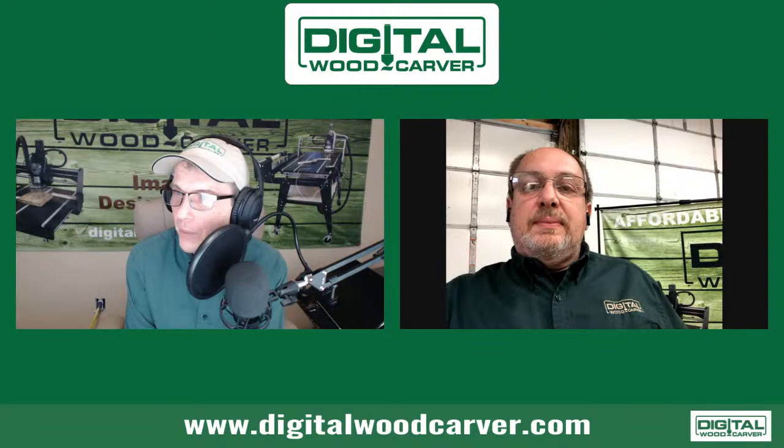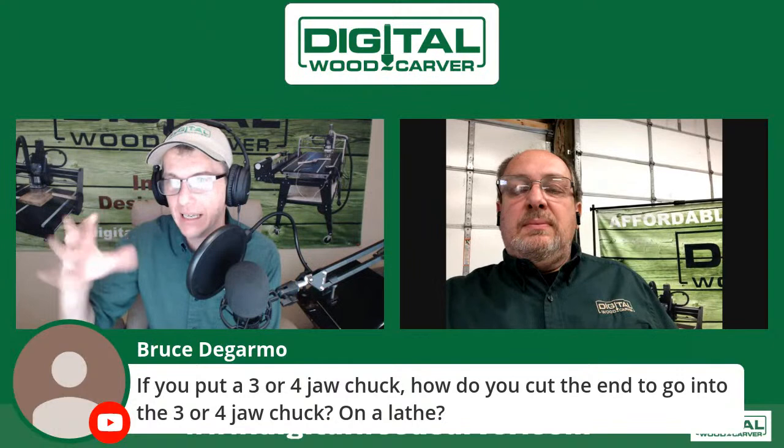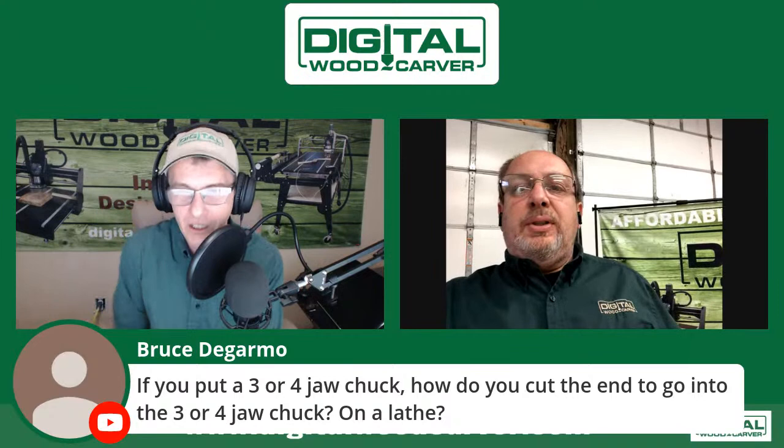Now, Burl, we're going to jump into a couple more questions here. Let me pull Bruce's question up. If you put a 3 or 4 jaw chuck, how do you cut the end to go into the 3 or 4 jaw chuck on the lathe? When I used to do it, I would round the end so the chuck could grab it. But I think, is it a 3 jaw or 4 jaw where you don't necessarily need to round the end? It'll grab on all four quarters, the 4 jaw chuck.